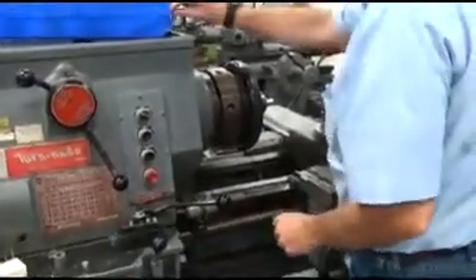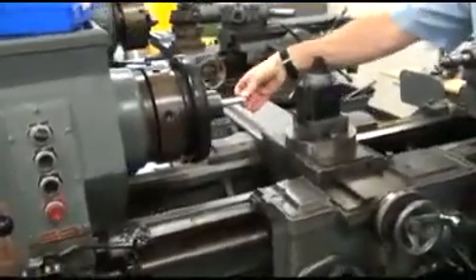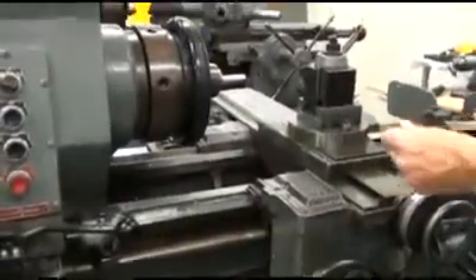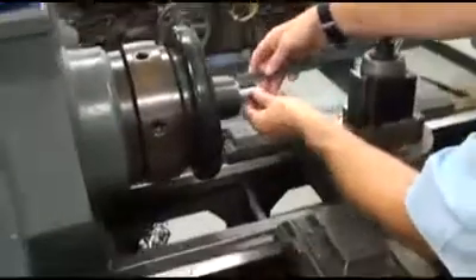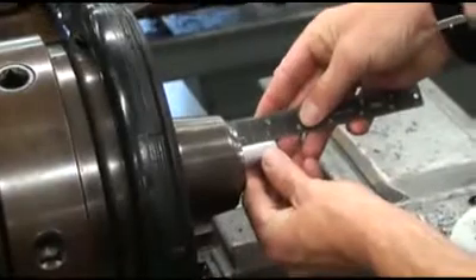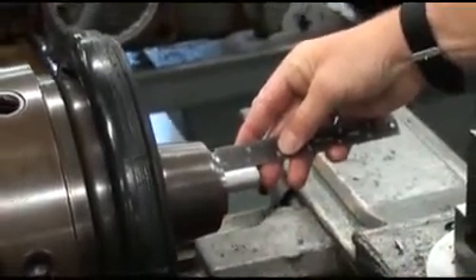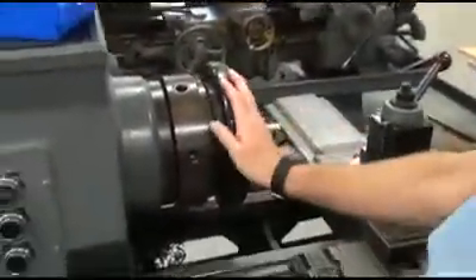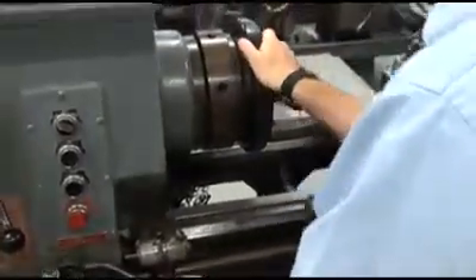What I need is a steel rule. I have my stock already inserted into the collet. Looking at the manual, it's asking me to extend the material at approximately one inch. I'm using the steel rule — that looks good right there. I'll tighten up — nice and tight.